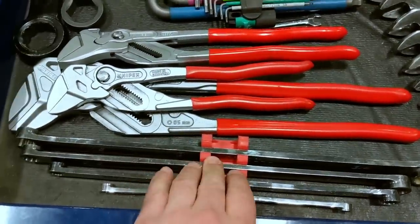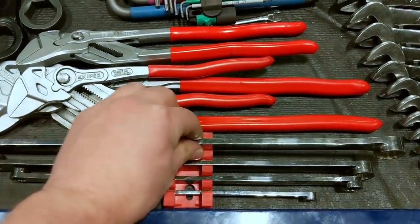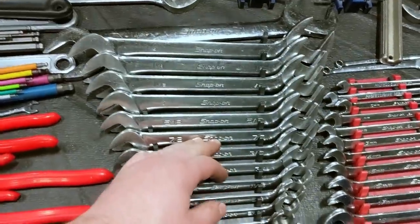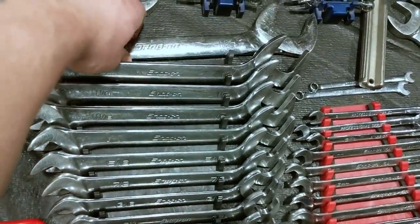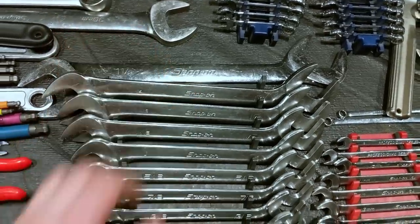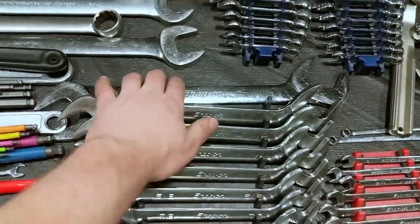These long wrenches are quite handy — I don't use them a ton but whenever I need them they've saved me a few times, definitely makes life easier. I've got these Snap-on offset wrenches from three-eighths up to inch and a quarter, and I just bought inch and a half separately because dash-16, at least with the Eaton narrow clip hoses on a JIC fitting, takes an inch and a half. That's probably my most common hydraulic line size. I love this wrench set and use it all the time.